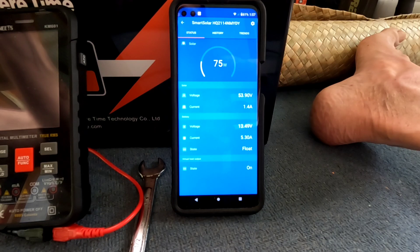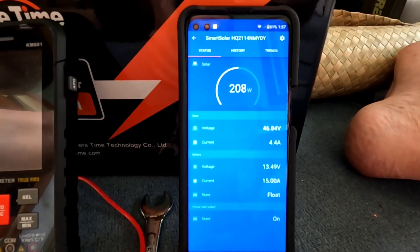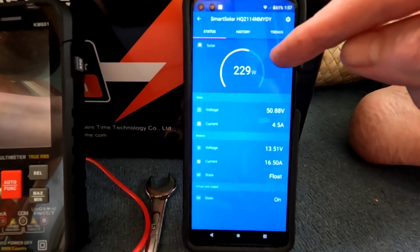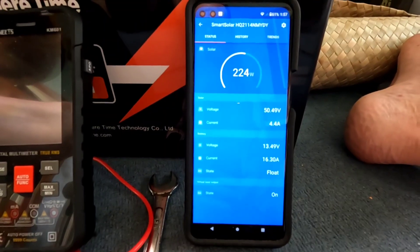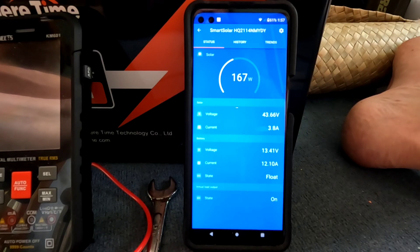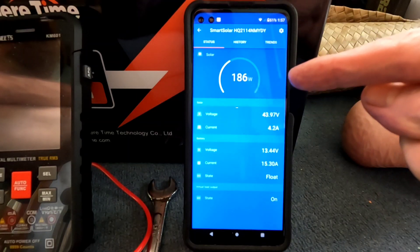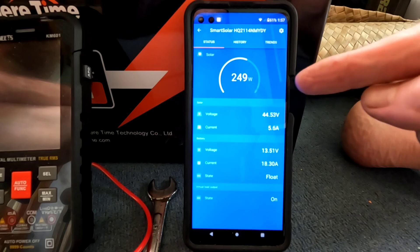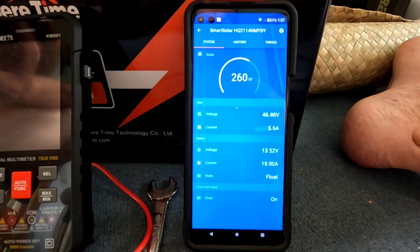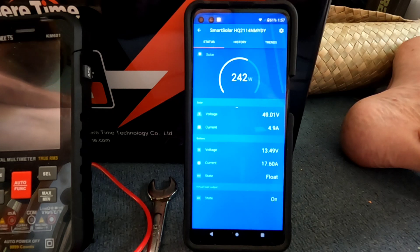With the charger reconnected, we're looking at 323 watts going through the watt meter running that 20-amp charger. The array has opened up to about 225 watts with the sun out, which is about as good as it's going to get under these conditions. Even when I get up to near 300 watts — here it's back up into the 250-watt range — that takes my net usage of this charger down to about 100 watts, depending on what's happening in the sky.